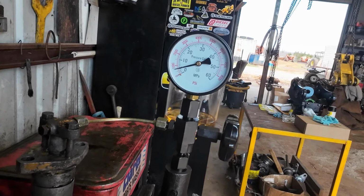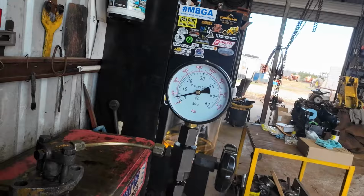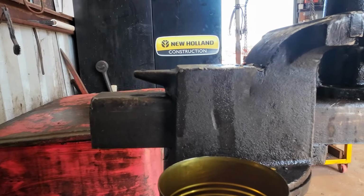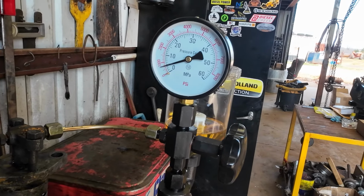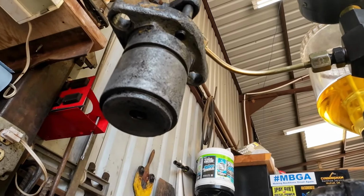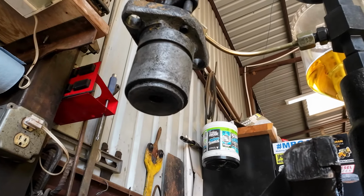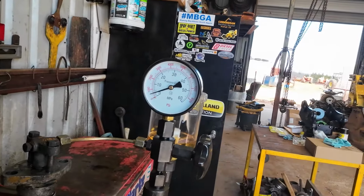You can see there, I got her up to about 700 pounds. It's holding, kinda, dropping off a little bit. But you can see when it just starts to crack, it dribbles. Kinda one of them old man problems, I think, maybe, dribbles. But if we dry that tip out and we look at it, yeah, it's making diesel there. So the thing is, this nozzle may work better than the one that's in the dozer that's missing. And that's kind of what I wanted to look at.